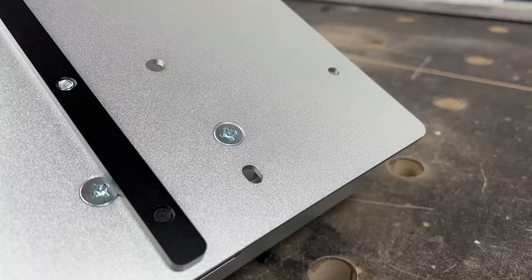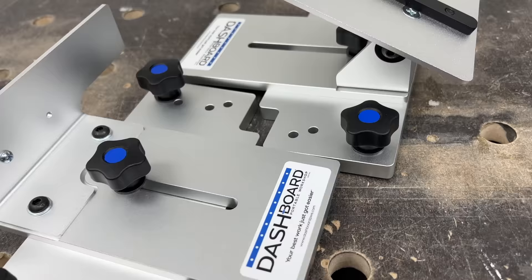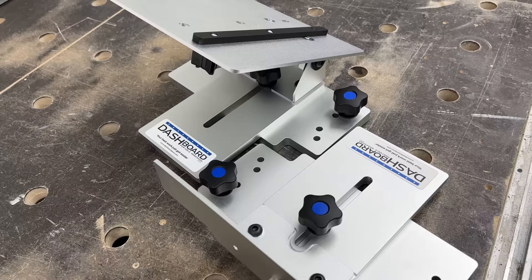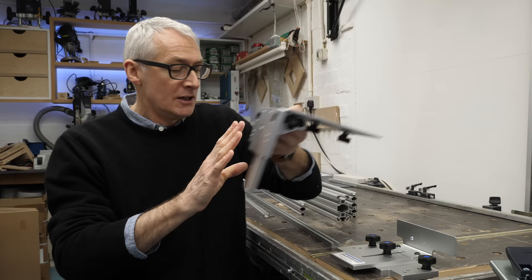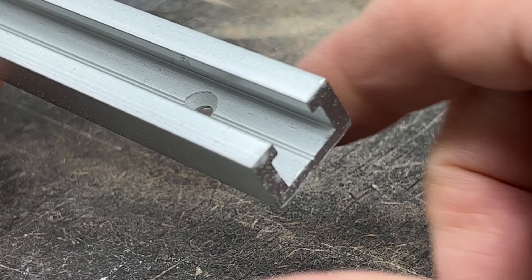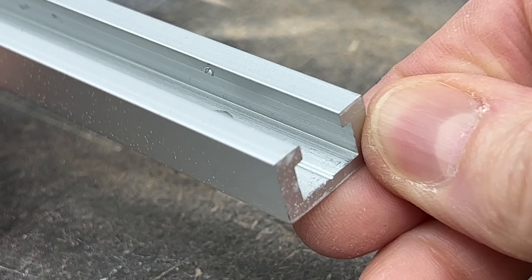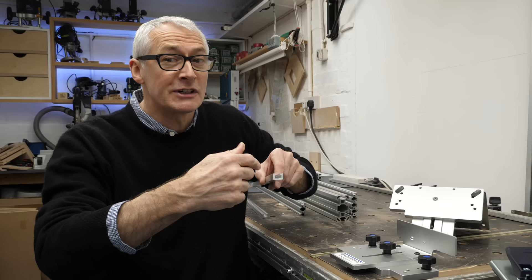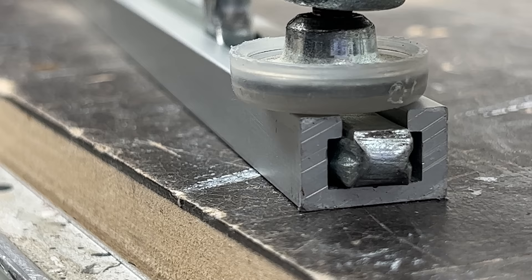The Dashboard set is absolutely fantastic quality and can be ordered with either fittings for the Festool extrusion or for standard T-track. The standard T-track fittings with 8-mil T-bolts that you get from Dashboard work perfectly with the Rutlands T-track I bought a while ago. This T-track is externally 19 millimetres or three-quarters of an inch wide, 12 mil or half-inch high, with internals measuring a half-inch wide by a quarter-inch high. Weirdly, the slot in the top is 8 millimetres, which is perfect for both rail clamps and the T-bolts supplied.